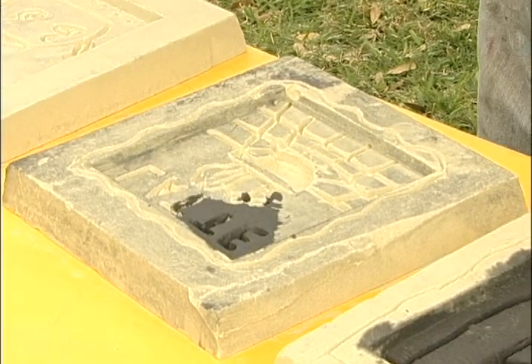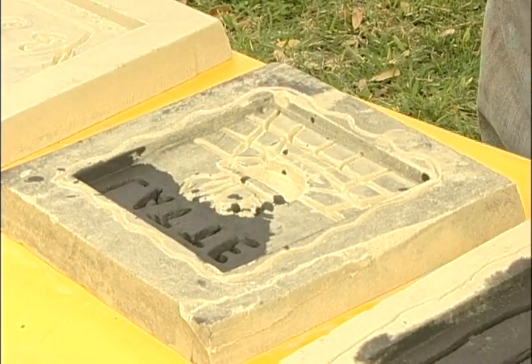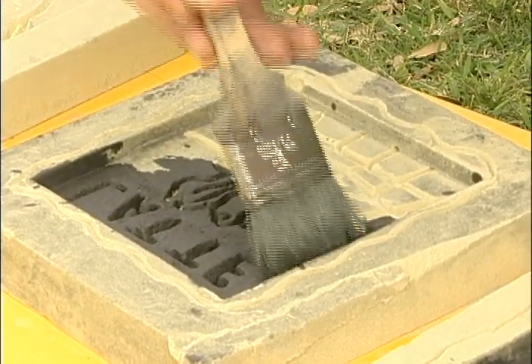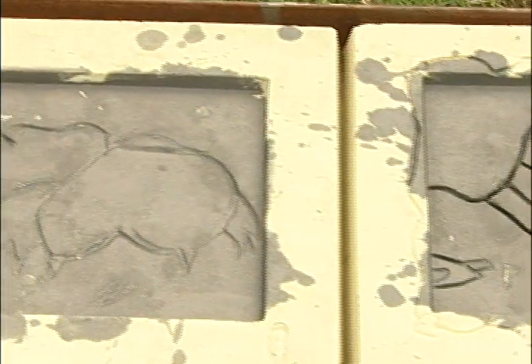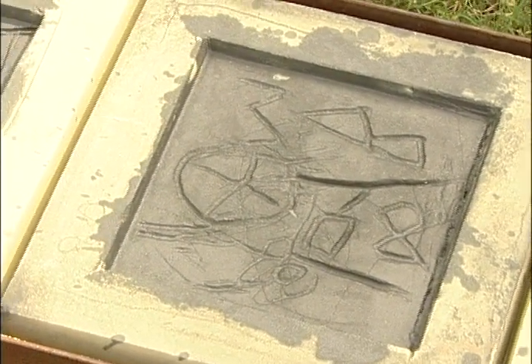Here one of my students is applying a graphite wash — graphite with denatured alcohol — and the purpose of this is to allow the aluminum to dance across the surface of that scratch block pattern without washing or eroding into the sand. Once they're coated, the alcohol is ignited, and as it burns away it beds the surface with the graphite.